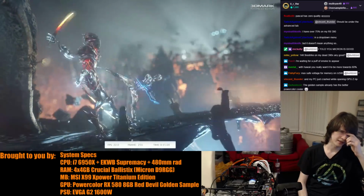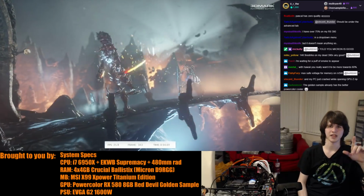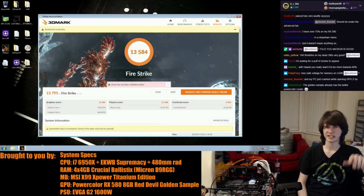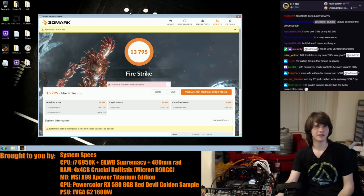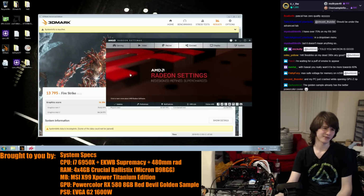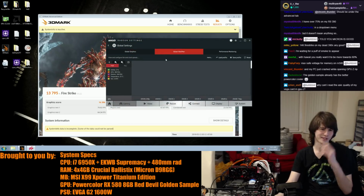And it's probably something like the CLDO. If you've overclocked Ryzen, there's a voltage in the motherboard BIOS called CLDO VDDP, which is an on-die voltage regulator for the memory controller. And that one is derived off of either core voltage or SoC voltage, and basically you can't have it lower. Actually, I don't know. But I think it's similar to that voltage on Ryzen. And it doesn't do a damn thing for overclocking, so that's why I'm not messing with it. The score... Okay, so now it's doing 16,400. I really want to know where the memory's going to stop.